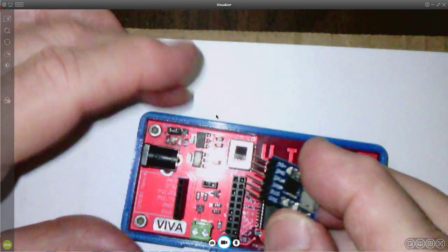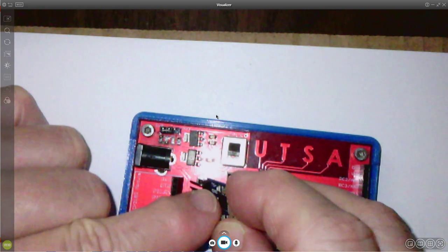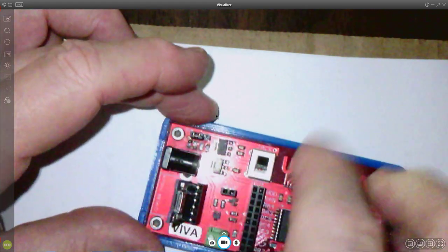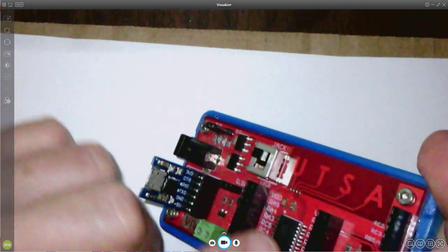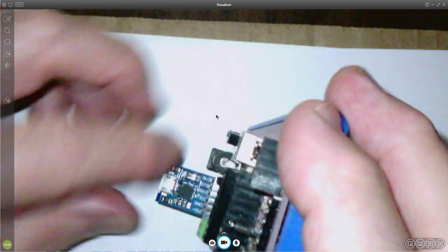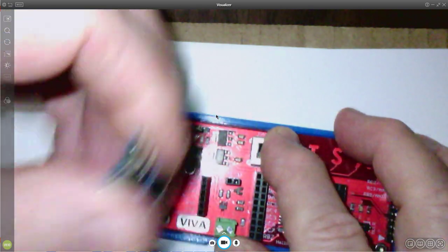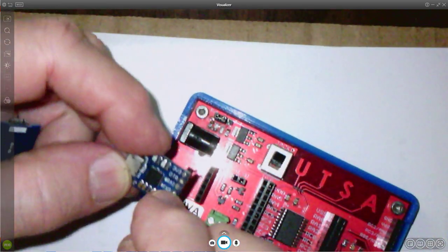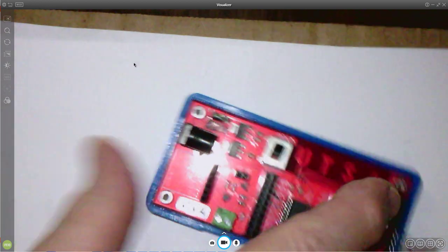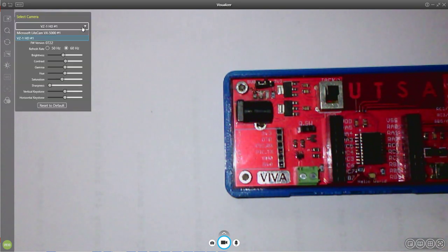Unfortunately, if you've got the right-angle header and you plug it in the wrong way, you're going to blow it. Don't do that. Look at it - notice it says 5 volts on one side and 3 volts on the other. You have to plug it in with the chip facing the microchip side and the back of the board facing out. Try not to plug it in backwards. They're 3 or 4 bucks, but no reason to burn them out.